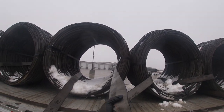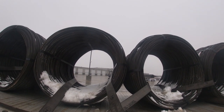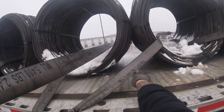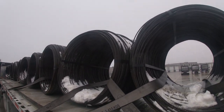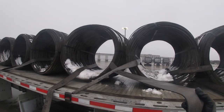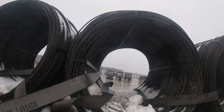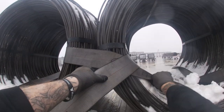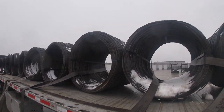Now, notice this is one of the straps we already threw through. To set it up as a butterfly properly, I take this strap that we threw back through and go underneath this strap right here. Take it underneath — no twists, twists are bad. Now the strap is underneath. I take this strap, ball it back up, throw it back through, keep all the twists out, and run it underneath like that. I'll explain why we do it that way in a second — just finishing throwing all the straps.